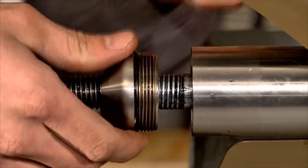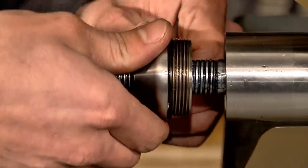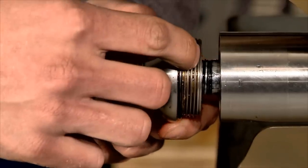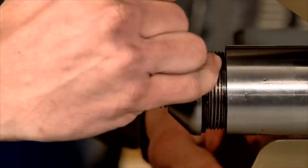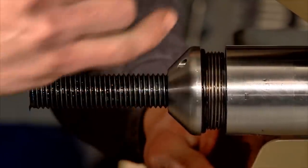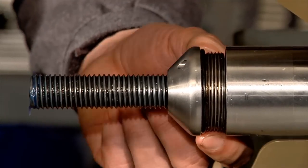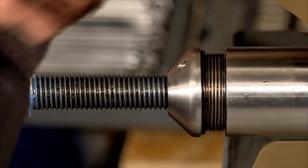When you get up here to the RevoClean groove itself, it turns into left-handed threads. And also, the threads on the bearing housing cap and the bearing housing itself are left-handed threads. Before I get there, I'm going to use a little bit of liquid thread sealant. If you have that, that's great. Teflon tape will work, or even a little bit of petroleum jelly or something like that will help ensure that you have a good seal.